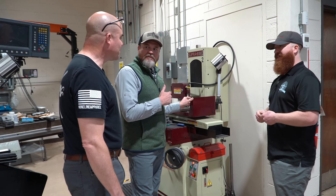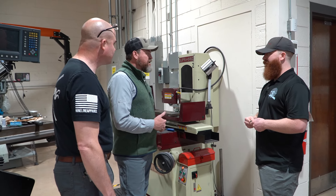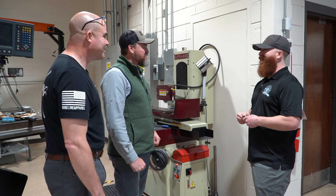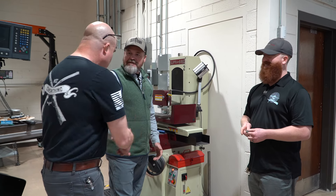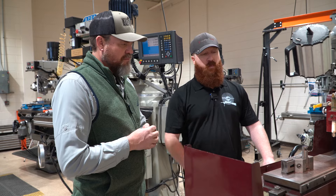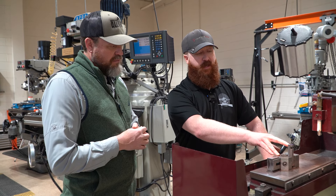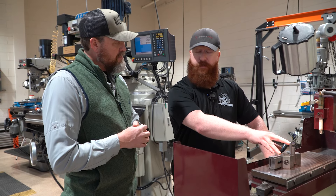One of the first things we've got to do to get this thing to shoot right is adjust the headspace. Most guns, headspace is done in the barrel, but on .22s it's actually done on the bolt itself. We're going to take this and get on the grinder — it's pretty hard stuff, so we need the grinder. I remember this from the last build — we used it when we trued the recoil lug on that .270 rifle.